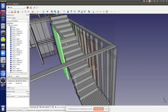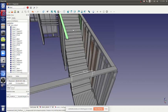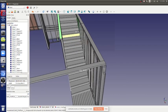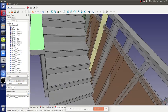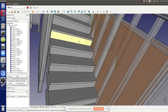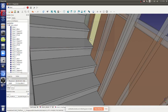You could probably assume that if we measure right between the opening on top, everywhere, we might get away with just one measurement. Ideally, it should be within like an eighth. Otherwise, you've got that little gap, and what are we doing to trim up that gap? We don't have any provisions for that, so the stairs go right next to the wall. So we gotta make them pretty accurate.